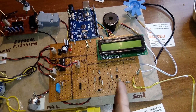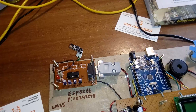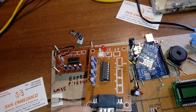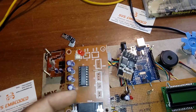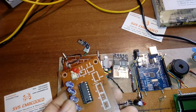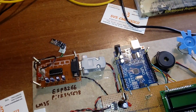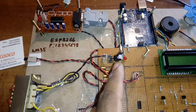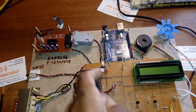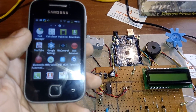I am using the ESP8266 Wi-Fi module. The hotspot password is 12345678 and it operates at 2.4 GHz frequency. The module must be paired before use. It runs on 3.3V power supply, which is a low-power module. Data is communicated via serial RXD and TXD lines. The RXD/TXD connects through a MAX232 IC, which sends and receives data to and from the Wi-Fi module.